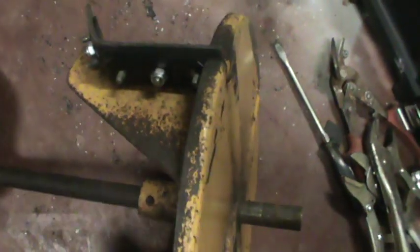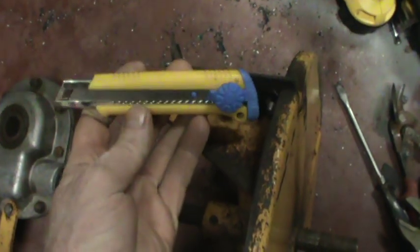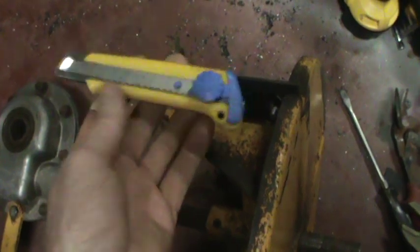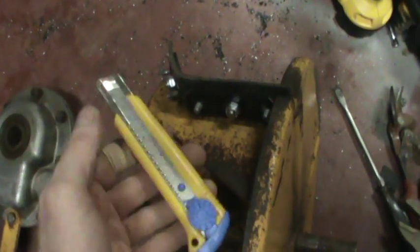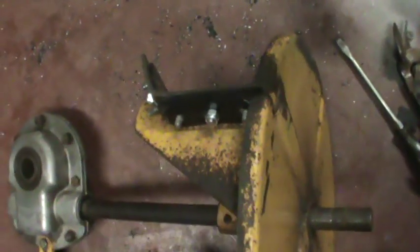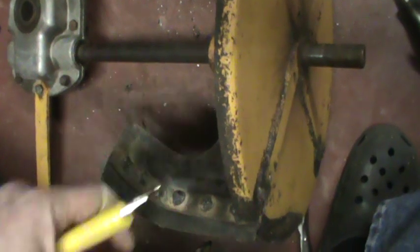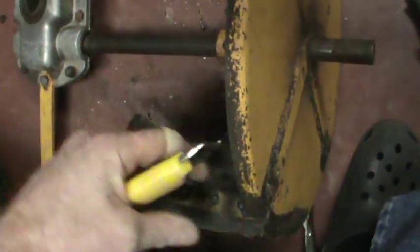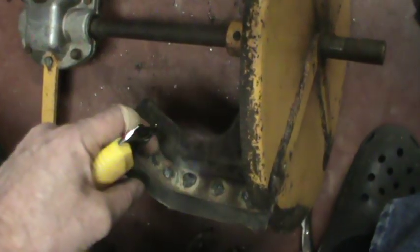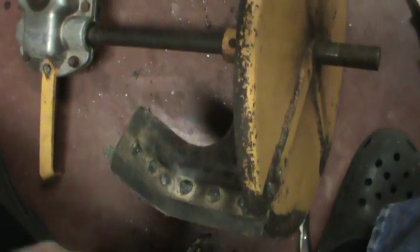In the video I mentioned — I had a repeated brain fart a few times — I mentioned an X-Acto knife. I meant to say a Gyproc knife. This one here is just something you buy at a dollar store, so obviously it's worth a dollar. You can buy ten replacement blades for a dollar — very inexpensive. Use that for cutting the end of the rubber here. When you're cutting them to width — your inch and a quarter, or inch and a half, whatever size you want to make them — you'll use some sort of straight edge and cut with a knife before we get to the point of putting it on. Later we'll be using it to trim it.